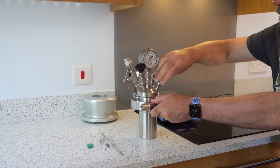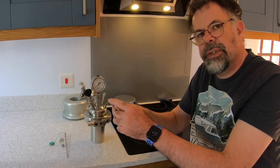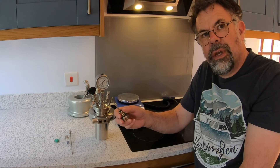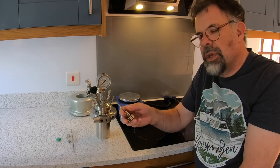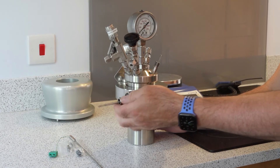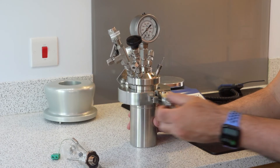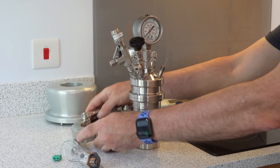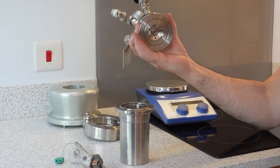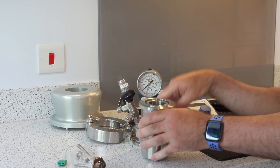So that simply undoes. At the bottom of this is a needle. The needle releases any pressure that may be residing in the vessel. It also makes sure that if there were any residues of materials that could block that port, it will still work and release pressure. The key then simply fits into the clasp, and then we can undo the tension on that. It's very, very easy to remove the clasp and dismantle the vessel into its two parts — the reactor top here, and then the base of the pressure reactor. As you can see, you can see the engineering there.